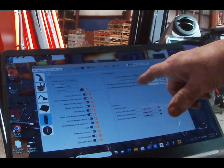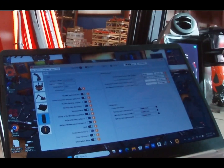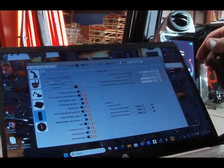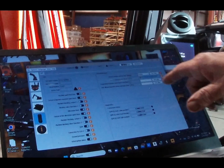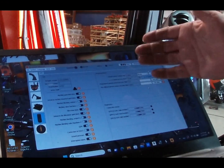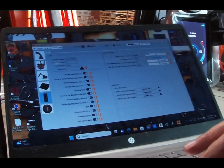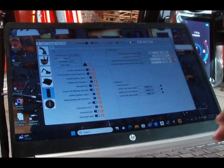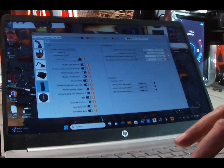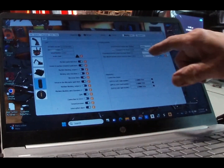Now you'll watch this. See that change right there? And then the 140, leave that alone because watch what happens when I pick the boom up. I could lower it a little bit, to about 120, because it's at 140. Boom pressure, empty bucket, we got about 115 bar right now. So just click it, we're going to go 120. Do 120 and then hit set. That'll change this value right there to 120.